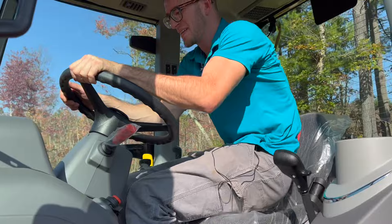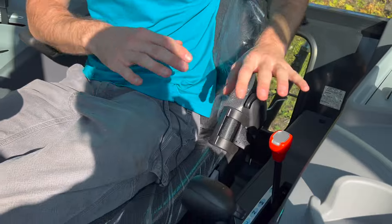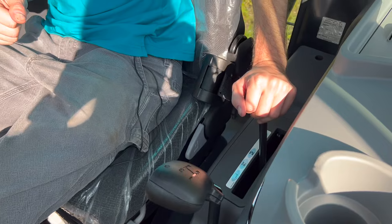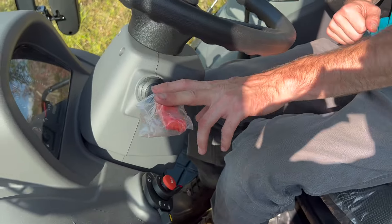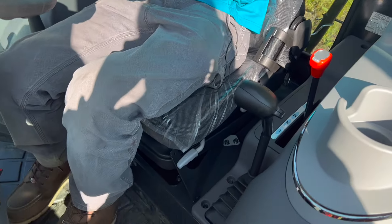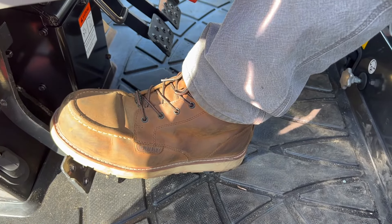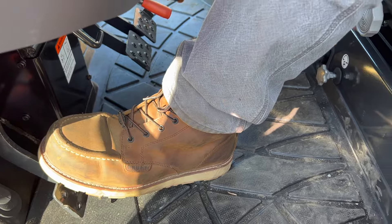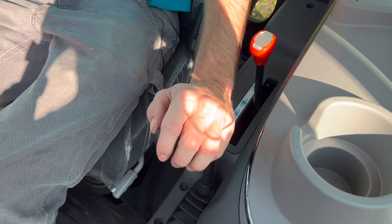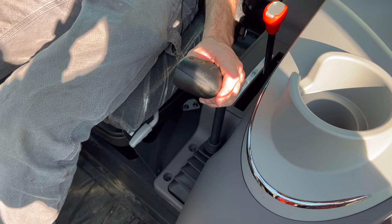Coming up in here, there are quite a few different features. This is a 12x12 transmission. You have a four-speed stick shift right here, a low, medium, and high range shift, and a forward and reverse. Starting this tractor is very simple — you push your clutch in, which is the normal safety clutch start-up, have everything in neutral, turn over your key, and fire up. You pick low, medium, or high range, then pick first, second, third, or fourth gear. It's not like a standard car — you can start this in third or fourth gear if you so choose.